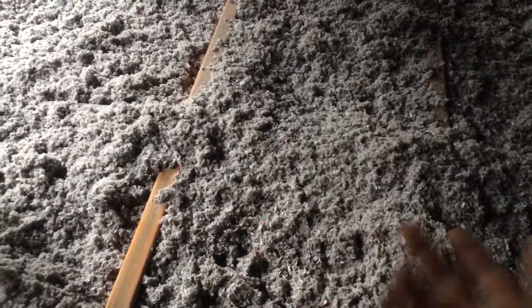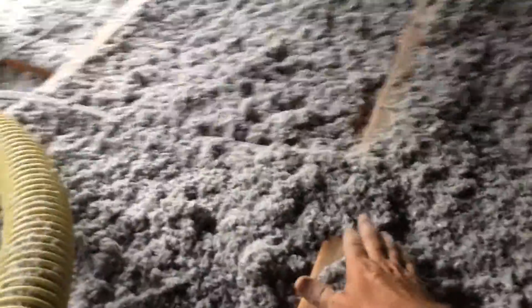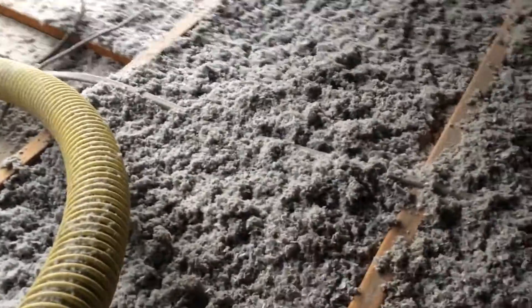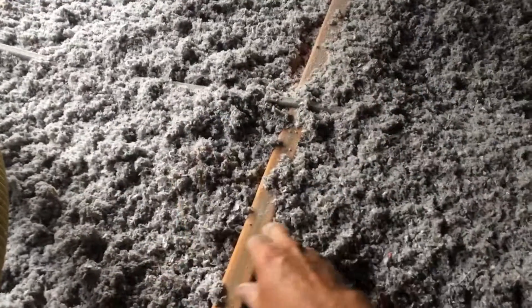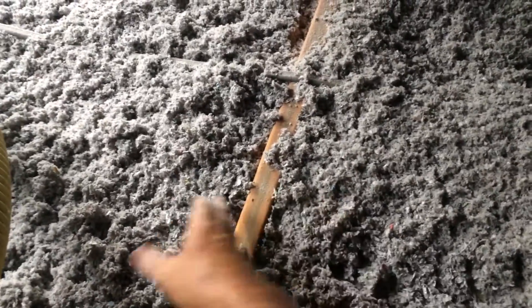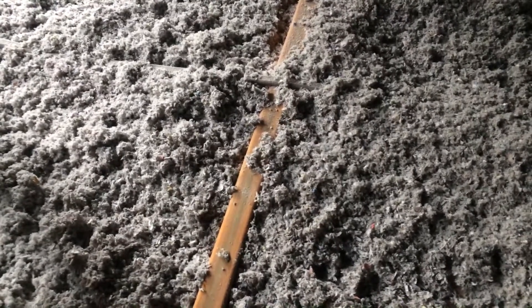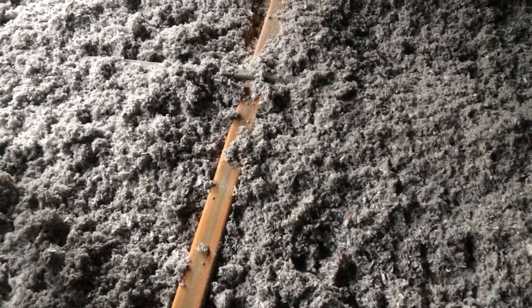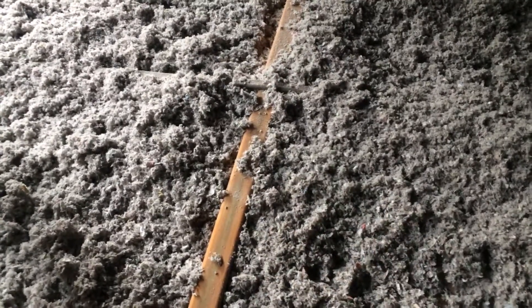Fire-wise, if this house has a fire up in the roof, the cellulose is far more fire retardant. If there were a fire, it would only be able to burn the top of the beam — the fire wouldn't get down past the cellulose on the sides. The cellulose will actually help protect a house in a fire and prolong the burn time, whereas polyester or fiberglass batts just melt away and expose the beams, and the house burns down.